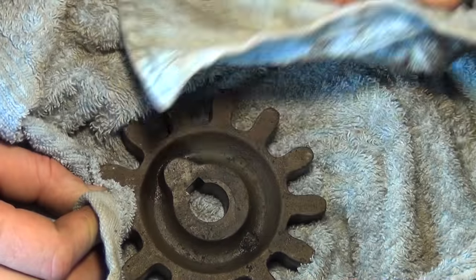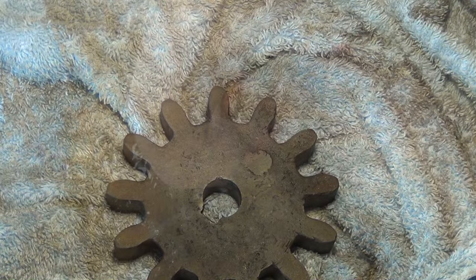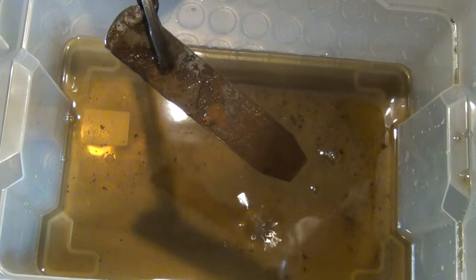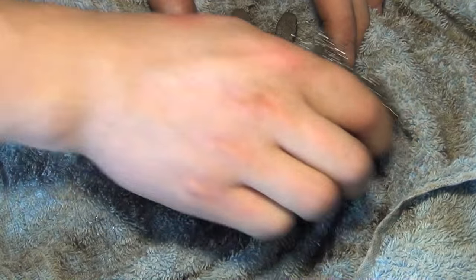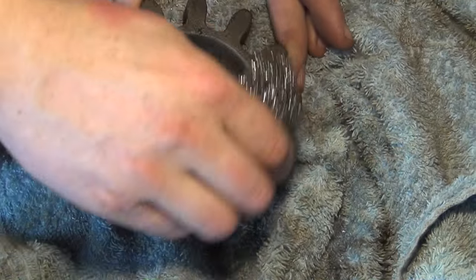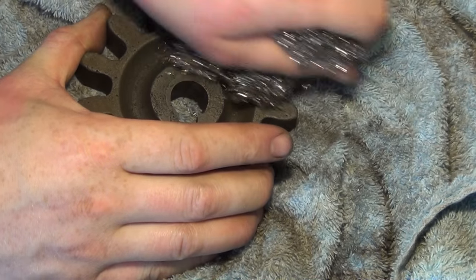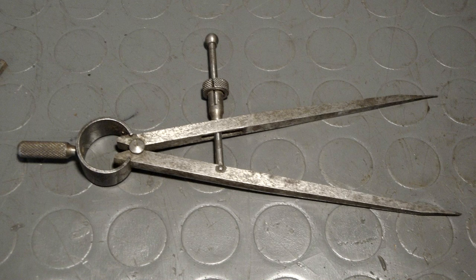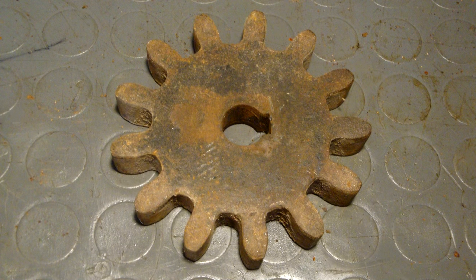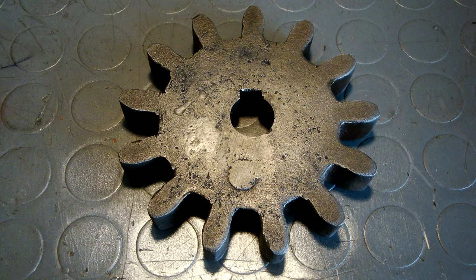After these 16 hours, all in all we have good results both with the divider compass and with the gear. The blade from the wood planer will take much longer — if this stuff is even strong enough to get off the thick rust on the surface. So to answer the basic question: is cider vinegar something you can use to clean off some rust from a part within a day? Yes, you can. But you should only use it for projects where there is only light rust on the surfaces, as with the divider compass we saw here. These parts were washed off under running water after removal from the tank. Some people use chemical means of neutralizing any remaining acid, but I simply used water and rubbed it all off well, and in this case that should be enough.